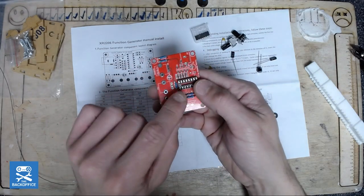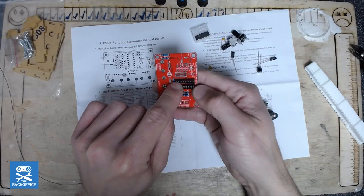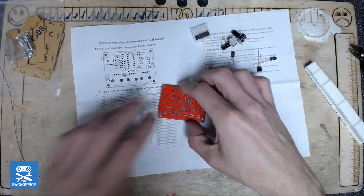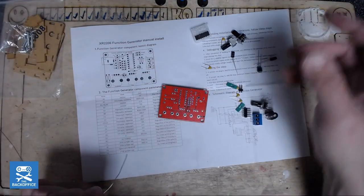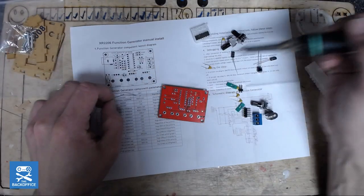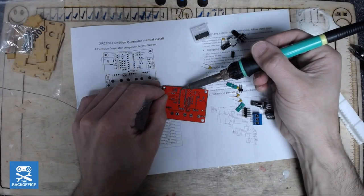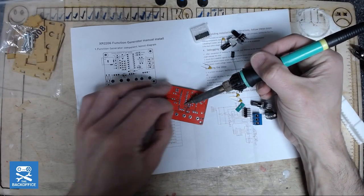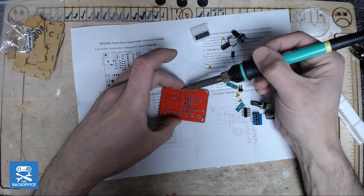It's made out of flat pressed metal. There's the sort of terminals in here. You can get these rolled pin terminals, which are gorgeous. They're the expensive ones. So if you ever see a picture of two, and they look kind of similar, one's more expensive, look closely at the things that the pins go into, because that might reveal to you why there's a difference in the quality.